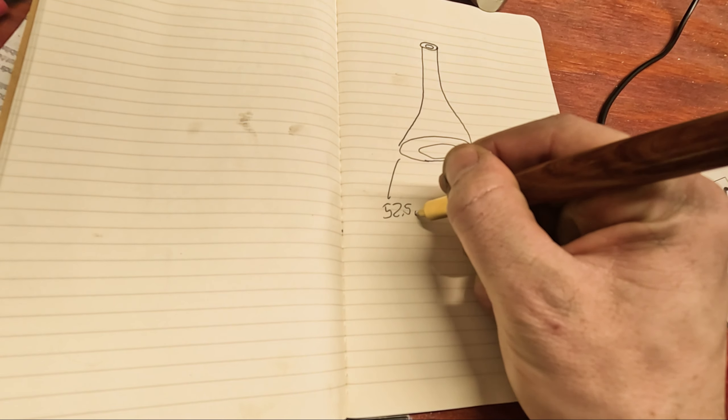This drawing looks kind of insane, but let's get on the computer and see if we can make it look better. 3D printing something takes a very long time, so to try and solve that problem I'm going to incorporate this PVC pipe into my design. Here's the idea — this piece of PVC is supposed to slide into this piece, then this will go over the seal on the engine and the output shaft comes up through here. Let's print it — it says it's going to take an hour and seven minutes.